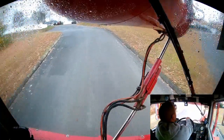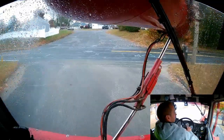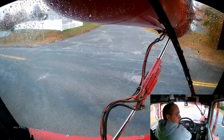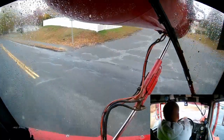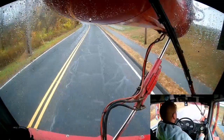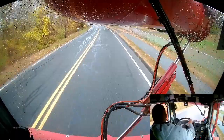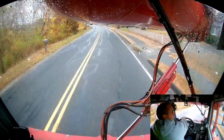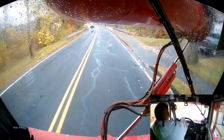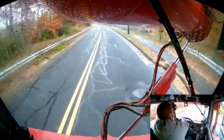They usually want it not super, super wet, but maybe a little bit on the moist side so it gets down and flows in around all the crevasses and whatnot. That's generally how it's done. There is slip form type curb that gets poured in this area. I personally have not actually seen it done myself, but it is something that is done in this area. But like I said, most of the curbing that I'm familiar with is what you're about to see.